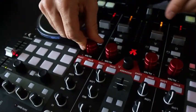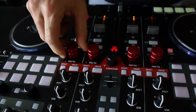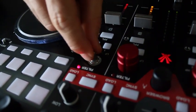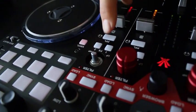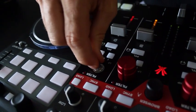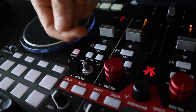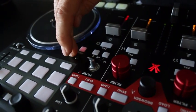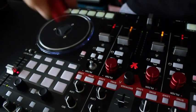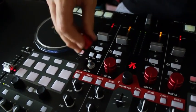Moving over to the filter section, this is a good example of how the controller gives you a sense of really good quality build. We've got big, chunky metal filter knobs. The knobs are actually metal Alps knobs and they're mounted using washers directly to the chassis, which is a really strong way of building a controller. Many controllers today will have plastic knobs that just come straight through the top sheet, so if you're really cranking on things you could get a lot of side wobble. This is actually the best way to build it — really strong and stable. It's more expensive, but it is the stronger way to do things.